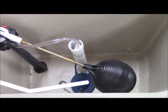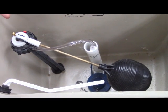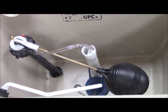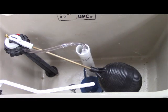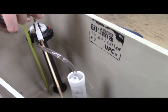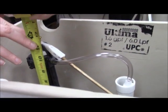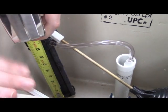First you're going to turn the water off. The fill valve is where you'll find the water connected — underneath it you'll see a flex line running from the back of the toilet into the wall, and there should be an angle stop there. Turn that angle stop off, then flush the toilet to get all the water out. The way we measure fill valve heights is we start at the bottom of the tank and measure all the way up to the very top of the valve — this one is about 12 inches. It must be shorter than the height of your tank.